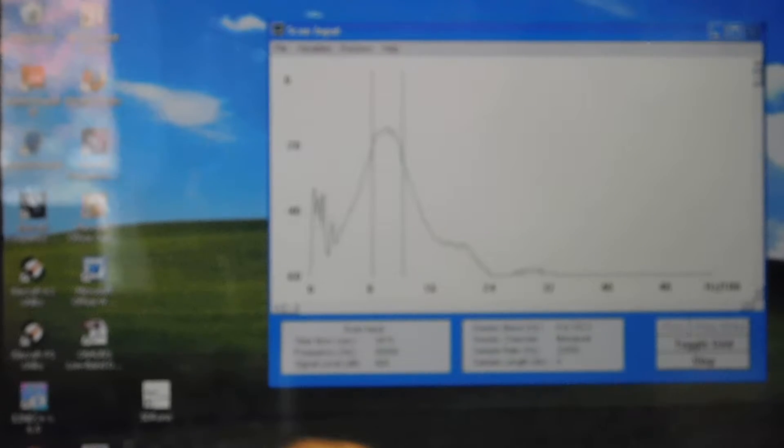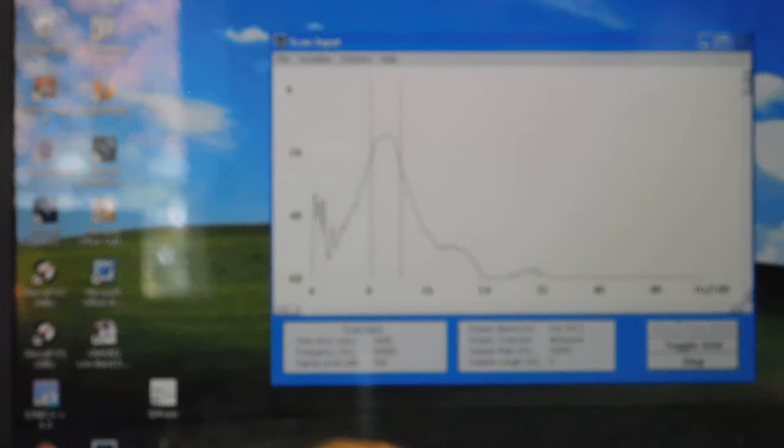What I wasn't too crazy about - look how high in frequency the peak is. The first vertical line is 800 Hz, and the peak shows up being just slightly over one kilohertz, like 1050 Hz. That's kind of high. I never realized mine was like that back in the day, but ideally I'd like to have it down around 650-700 Hz. So when we put the new filter in, we may have to adjust the BFO a little bit and see where it all winds up, but this will be an interesting project.